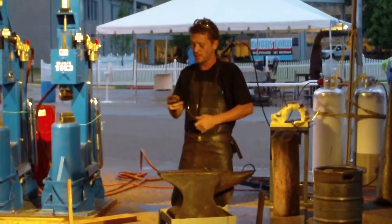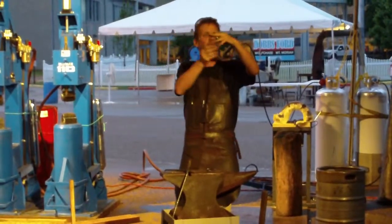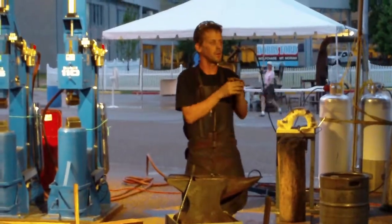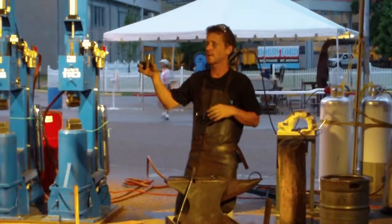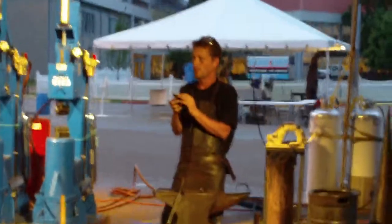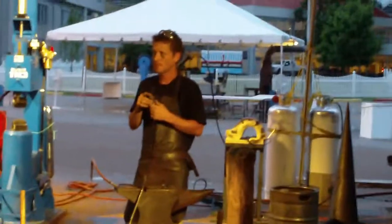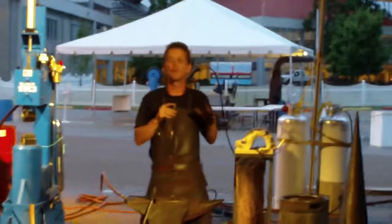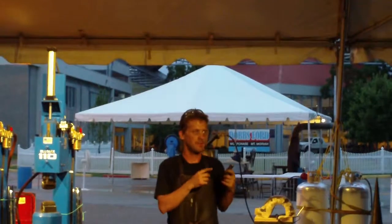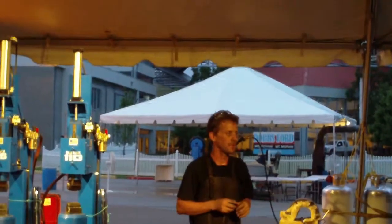When I finish this H13 tool, I usually put it in vermiculite like this, with just the edge outside, and let it cool really really slowly. If it takes something for a piece like this, after 10 hours it may still be warm. Because this area I want it to be as soft as possible. Believe me it's very hard also — the H13 gets so hard. But if it gets too hard, if you overcook it or cool it too fast, it can be very very dangerous.